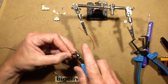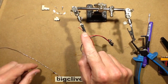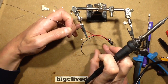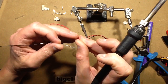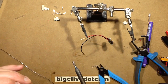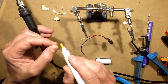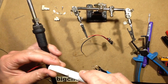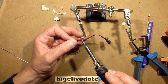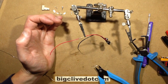The clean joint is good when putting it into heat shrink sleeving. I'm cropping the other end of the resistor down to about a quarter of an inch, 5–6mm, and gripping it in the helping hands again, flowing solder onto that end. The lead I've already cropped — one end is already stripped and tinned — but I'm re-flowing that with lead-based solder, which just works better than lead-free and produces a nicer, cleaner joint. Then putting the two pre-soldered connections together and flowing them again for a lovely clean shiny joint.